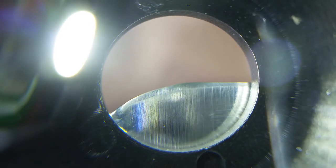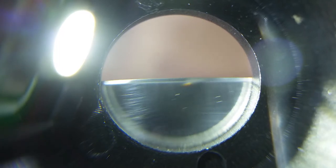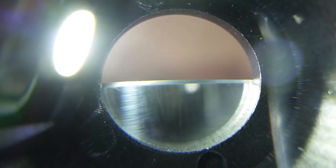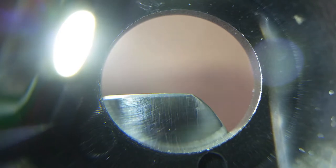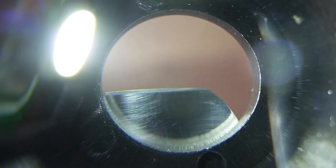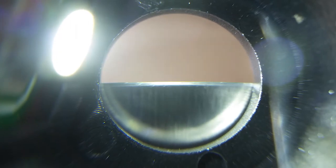Okay, so now we've got a bevel set. Let's see what it looks like. What we're looking for is to have that bevel even from the very heel to the toe all the way down. There's that bad spot, but we've got it worked out. The toe has got a skinnier bevel than the heel — maybe a little bit. Now this side — the bevel looks really even all the way down so far.